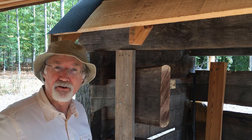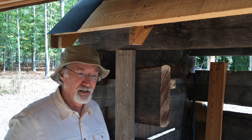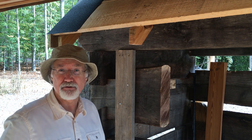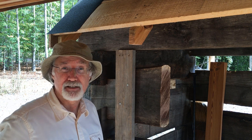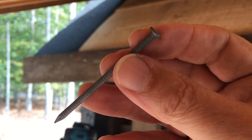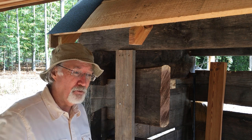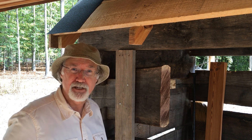The nailing holding power when driving a nail into end grain is not very strong, so it's a good idea to put quite a few nails in. You definitely want a nail that is rot-resistant or rust-resistant — stainless steel is best, but galvanized is a close second. A ribbed nail or spiral nail will also tend to hold better in end grain.